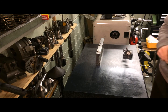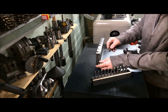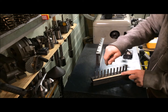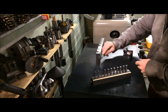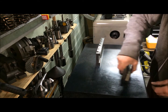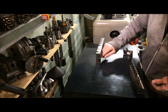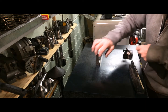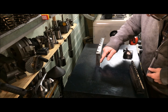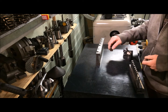However, if I use these as reference pins — they go down two thirds — they should be okay enough, but I can also use proper precision pins here. I am able to measure the amount of wear in the dovetail, but since this is a compound measurement where I rest on the angle surface, what is on the flat side I can't really tell.